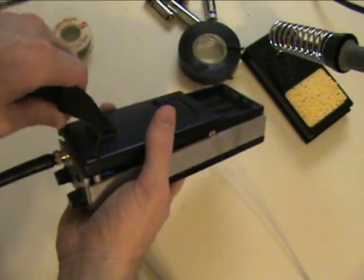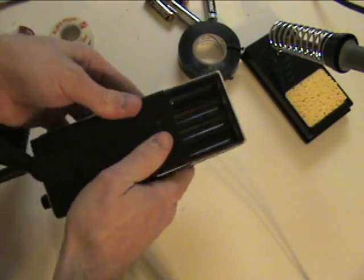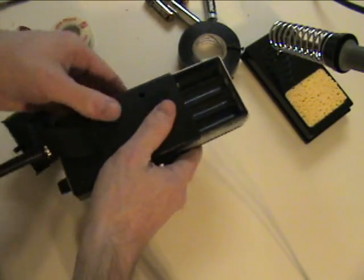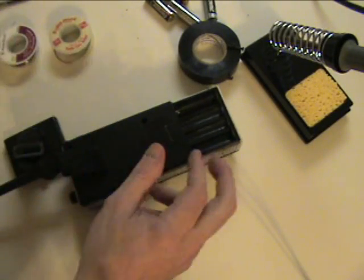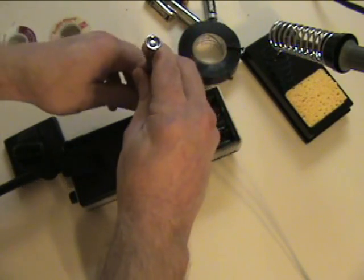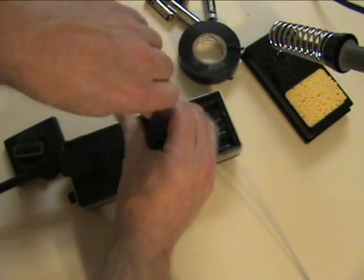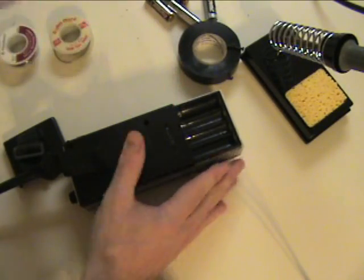After you've modified your CB radio, you obviously won't be able to talk on CB channels anymore. CB channels run in the 27 MHz range. By replacing the crystal inside of your CB radio, you've actually tripled the range that your CB is capable of receiving and transmitting on. And it just so happens that 6.5536 MHz gives it the range it needs to be able to listen and talk to drive-through frequencies.